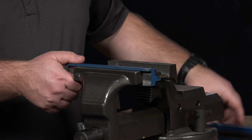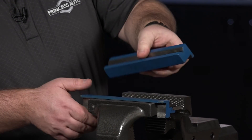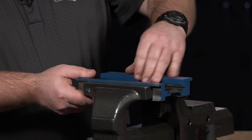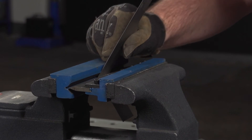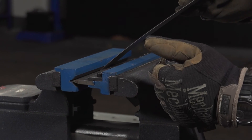You install one side of the bender in one jaw of the vice, and then the other side simply installs on the other jaw using the magnetic holding power — they've also got a lip that they can hang on. Now that they're installed, all you have to do is put your sheet in, close the vice up, and you can start creating your bends.